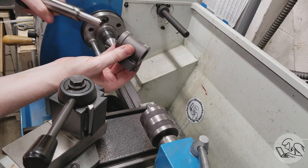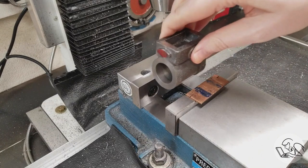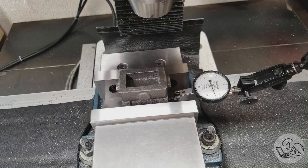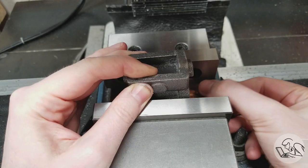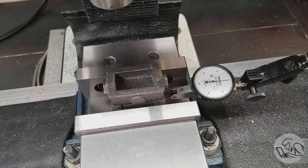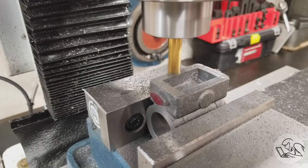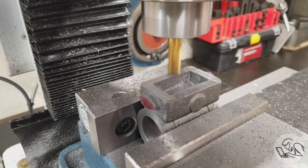With that bullet dodged, I can set up to machine the steam chest. Over to the mill, I'm going to set it up vertically so we can do all of the operations on the end of the steam chest. I've got some copper in there, and I'm using the indicator to make sure that the bore is horizontal. I had to shim it a little bit, but a few shims and a lot of indicating later, we have it sitting level. Now I'm going to square it up as best I can using the side of the casting, and then I can clean up the edge of the steam chest — that's going to give us our primary reference surface.